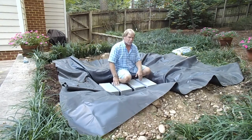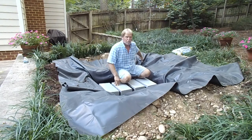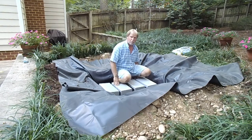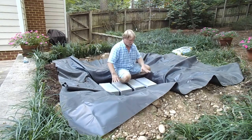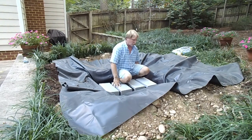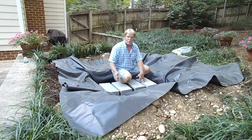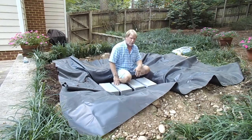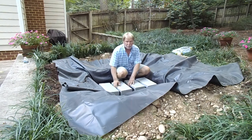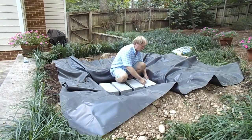Now the way we're setting this up, this is the North Carolina Basalt. There's an electrical plug right over here — you always want to consider where your electrical hookup is. We're going to put the pump access panel back here in this corner. You notice we have the cinder blocks away from that corner; we want to leave room for the pump to go right there. We're also going to come up through the middle of our grate system to run our flexible tubing, so right here in the middle we're going to have a gap between these cinder blocks so we can run that tubing up through there and attach it to the bottom side of that rock.